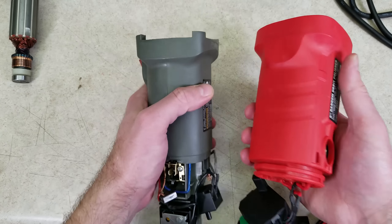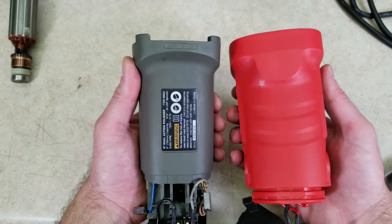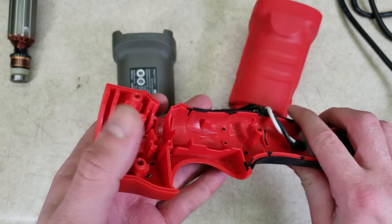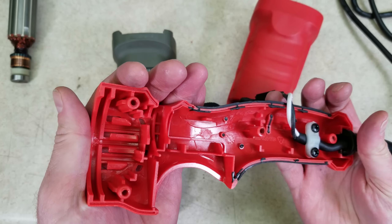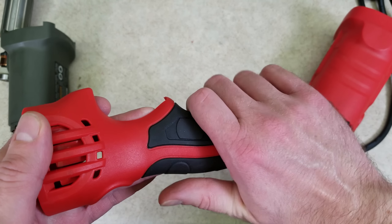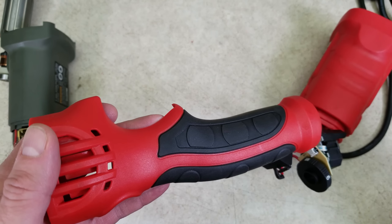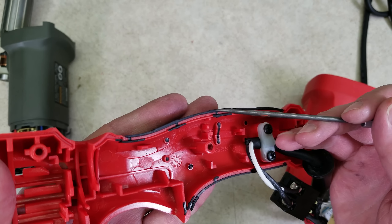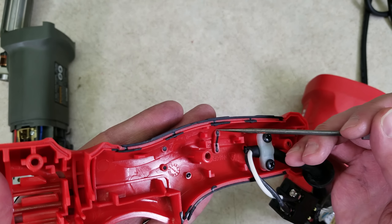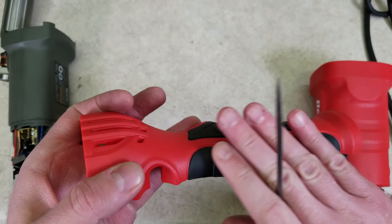Both of these use a good quality material for the bodies — PA6GF30, so nylon reinforced with glass fibers. On the new one the injection molding is more detailed and very cleanly and nicely done. The new one also has rubberized overmolding to help with grip, which is kind of a personal preference. The overmolding was nicely done — you can see all these holes where when it was shot on, it filled the holes and locks the overmolding in place; it was not just molded onto the outside.